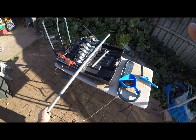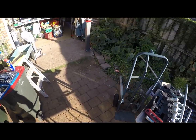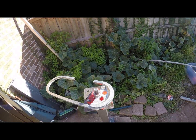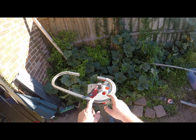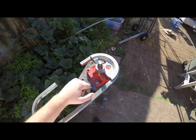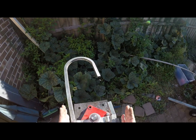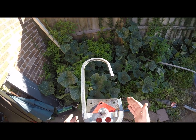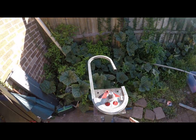This is my extension bar — look how long that is. I'm going to roll it all. This is what's left after I've finally bent my two bits of metal. To get the piece of material away from the die, I've had to put an edge on right here so that when it rotates around it can actually lock in with a lug so that I can finish off to get that 180. That's pressed in there so tight that I actually need to get a sledgehammer, take this off, put the bar through it, and knock it down.